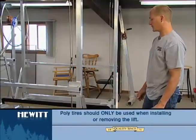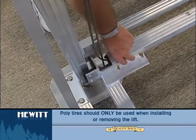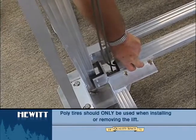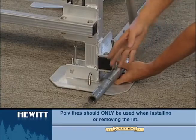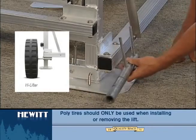Corner assist for vertical lifts that have slides on the corners — not the rollers. This would be the bed and the slides that are in the corner, the corner assist wheels. On this type of lift, slide onto the lift using the existing poles and the cross beam. Then the wheel will slide onto the stub axle and is secured with a washer and a cotter pin on the outside of the tire.